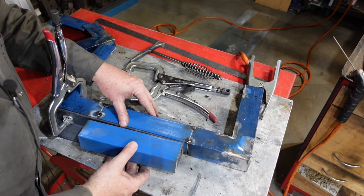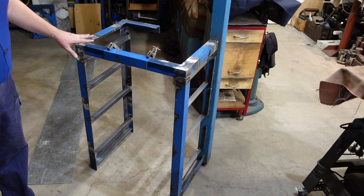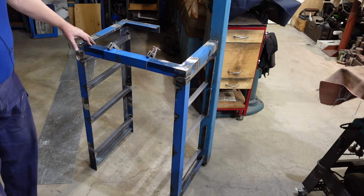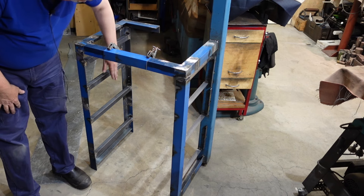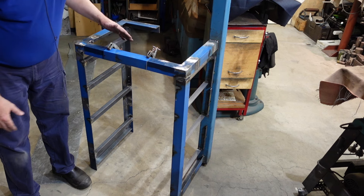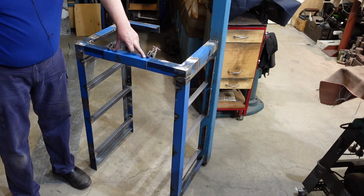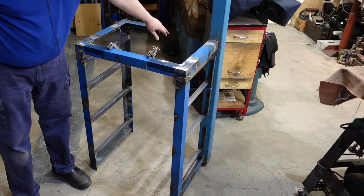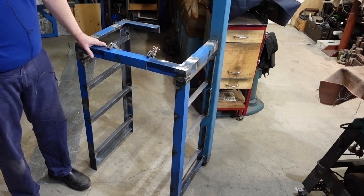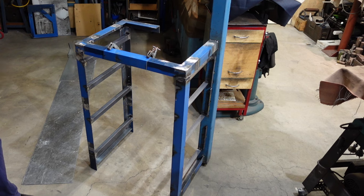The idea is to use your material as efficiently as you can. These were just a smidge longer — I've cut them to size, put the bevel on both sides, and that's all ready to fully weld. Here's a progress shot at roughly the size it's going to end up — a little bit taller, a little bit wider, a little bit deeper. You can see the basic strategy: I've got bits of angle in here that are going to have the drawer slides in them. Once I've got those set up I can work out with some degree of accuracy what the length in here needs to be.